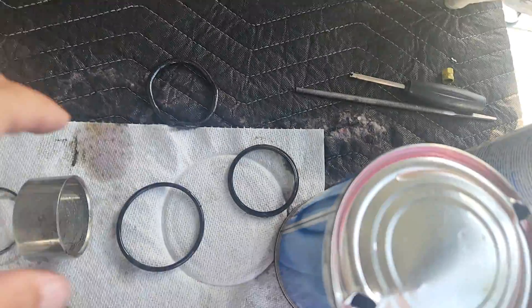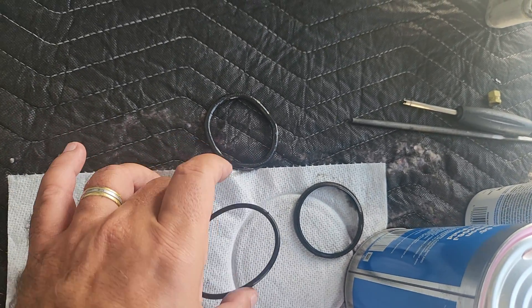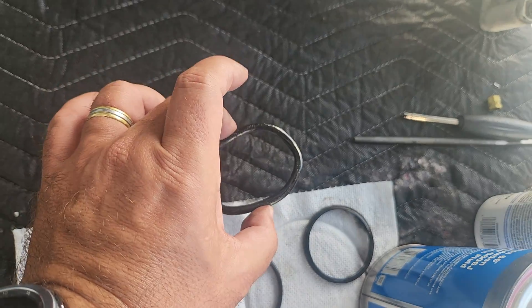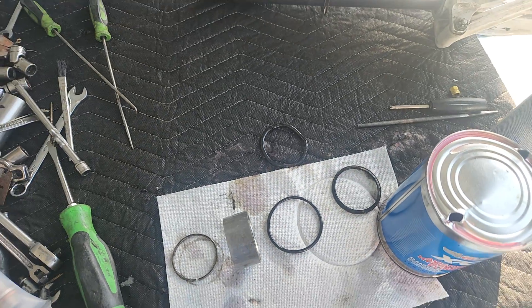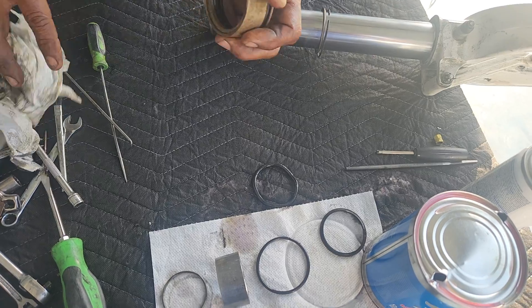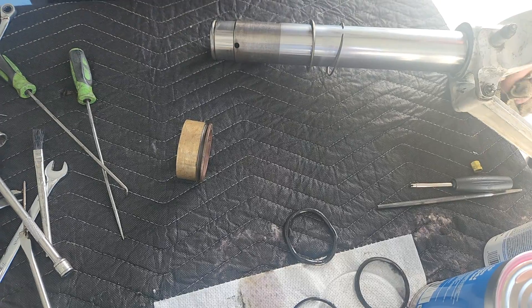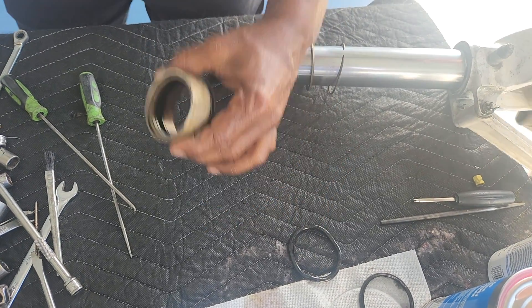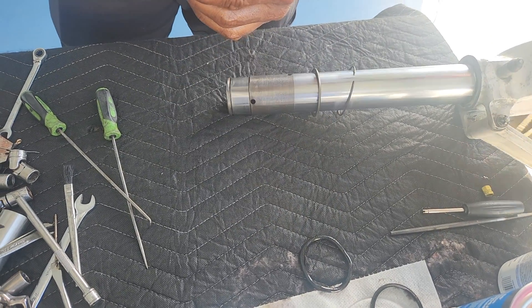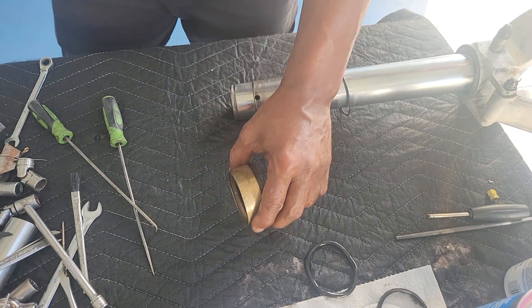One and two — we clean this off. So this one's actually pliable, yes. That one is pretty good, this one's pliable. But this one's hard — that one was probably the one that was most likely leaking. Now if you notice, there are two braces inside on either side. What they have done now — they actually have a whole o-ring that's kind of square that fits right in there with the two here.